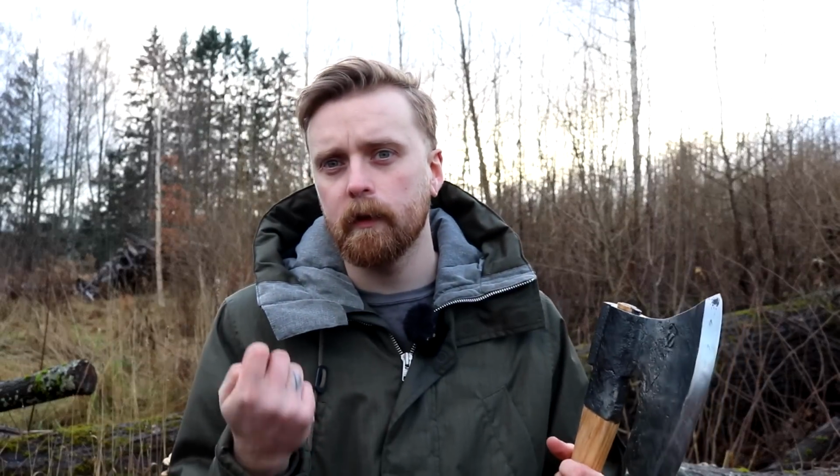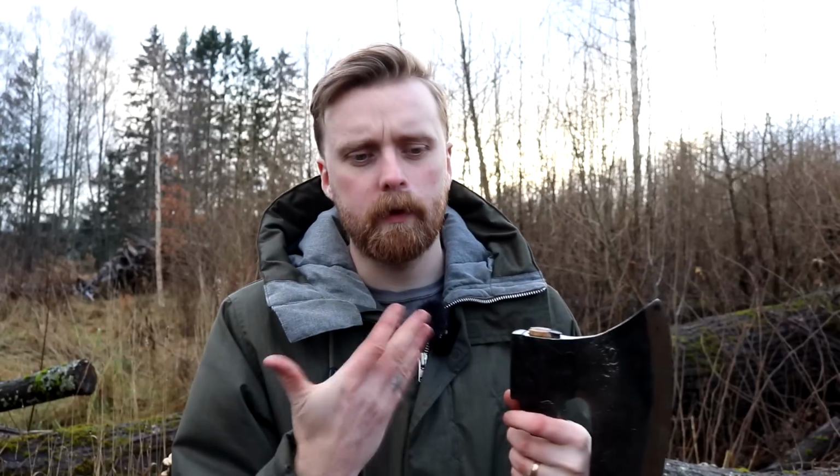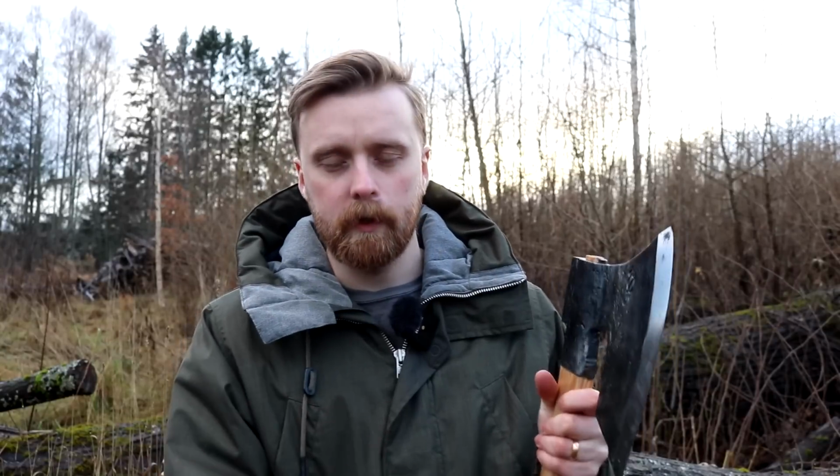Another way to do it is like I did in the Scandinavian hewing axe video, where I take and wrap the backside of the eye around, and then I take the body piece and weld it to that. So that's a quite tricky weld. Or you can do it the Swedish eye style, which you saw in this video. And if you were to try this, I would suggest that you learn from my mistakes.